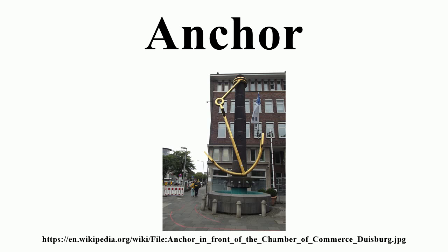When this happens, the anchor may be pulled out of the bottom, and in some cases may need to be hauled up to be reset. In the mid-19th century, numerous modifications were attempted to alleviate these problems, as well as improve holding power, including one-armed mooring anchors. The most successful of these patent anchors, the Trotman anchor, introduced a pivot where the arms join the shank, allowing the idle arm to fold against the shank.